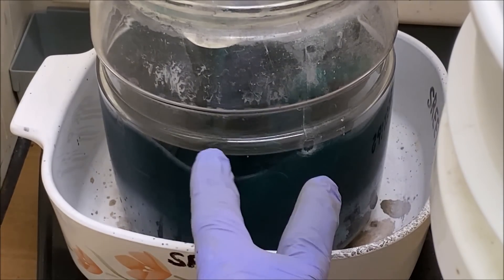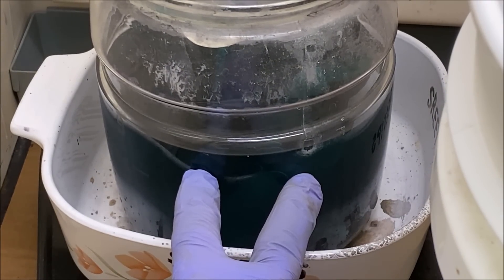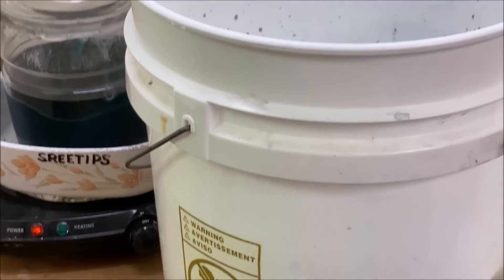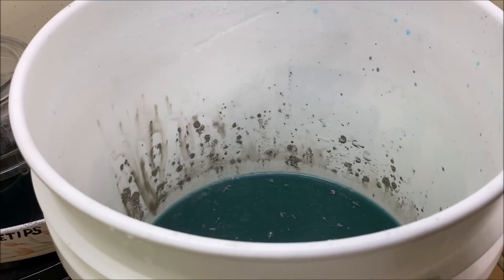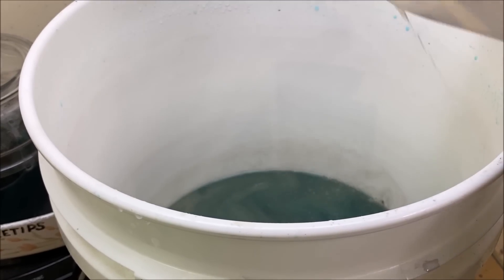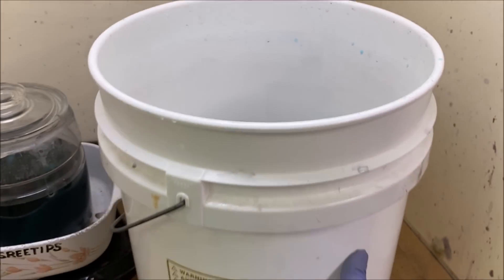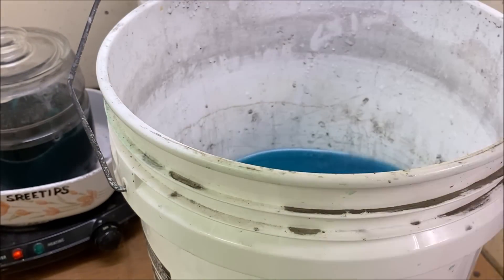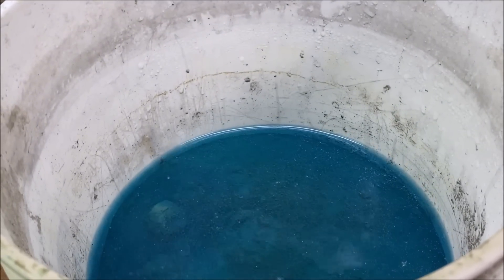I'll put that silver in solution, then filter it to get all the solids out, and add it into our reaction bucket — it's full of copper — and cement silver out onto the pieces of copper in my reaction bucket. This will produce some fumes so I leave it in my fume hood. I hope this gives you an idea of what's involved in refining this silver. And if you look here, I've got another reaction bucket that I've started, and this thing is half full of cement silver.